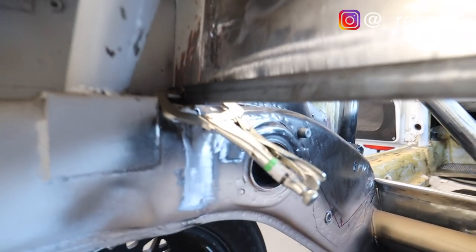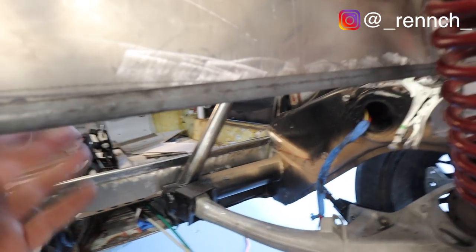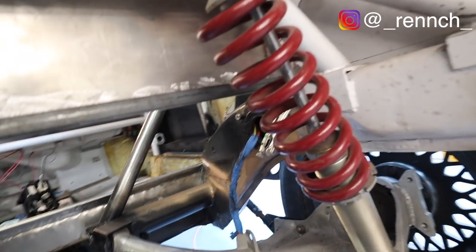All right, after about 15 minutes of grinding, I got this part all cleaned up, and I'm gonna weld it in here to stop any oil canning. It's gonna give this center section support, and then everything else should be pretty well supported, but this part in particular I was worried about. I know a lot of you guys said to put beads in, but I don't have a bead roller. So that is a no-go, but this I hope will do the trick.